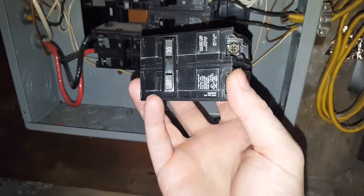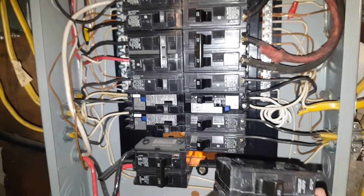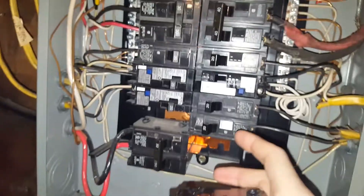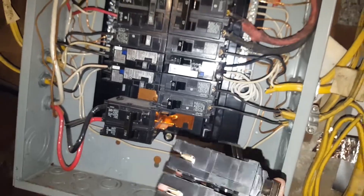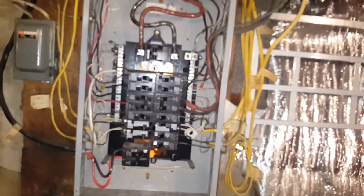When I turn the power on, if I have the conductors going into here — which I will, putting each one in — then this will be a protected circuit, protected by this breaker, and the circuit will be hot. Then my water heater will heat the cold water into hot water. Just make sure you have the right size breaker. These actually come in slimmer versions; mine don't, I have the older style. 30 amps is correct. I'm going to cut and strip it properly, being conservative with how much I strip at first.